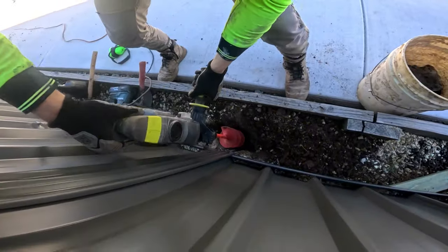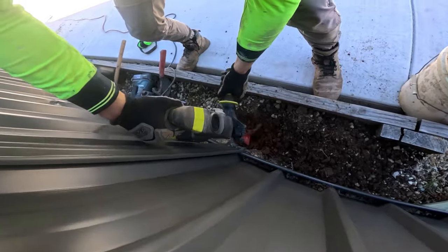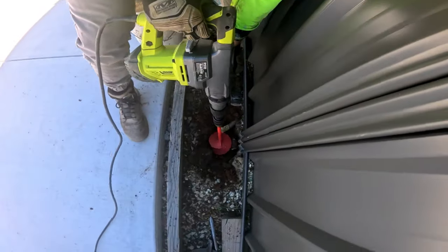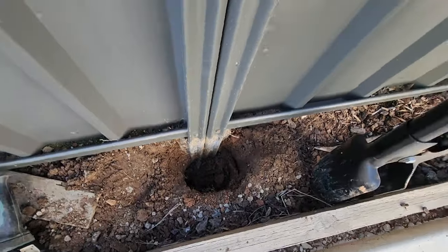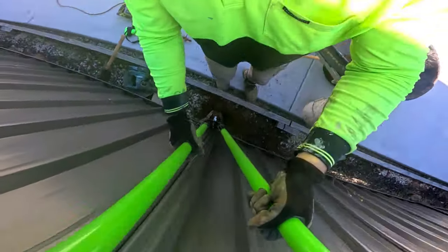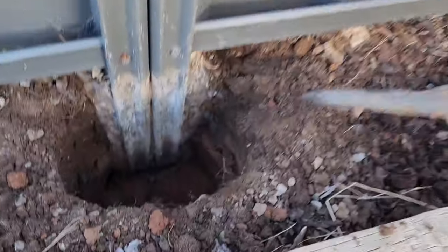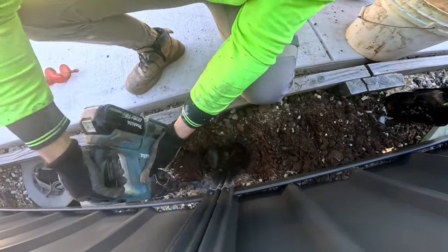Again, being careful. You can use a little hand tool, but I'm going to use a post hole digger — and these things are a lifesaver. Well, a time saver. Now we've gotten rid of the excess soil, we've got plenty of room to jackhammer the rest of the concrete from the foundations into the hole we've made.